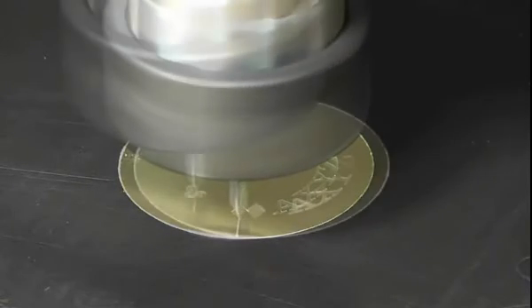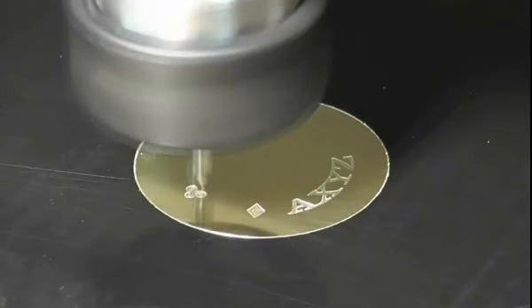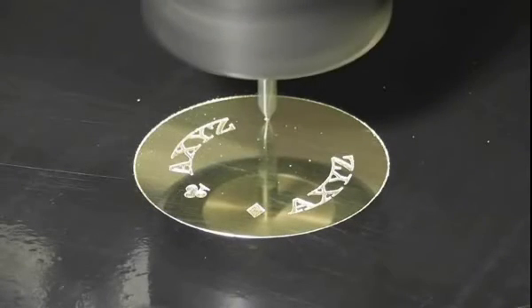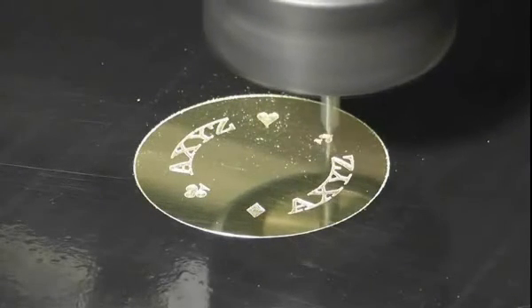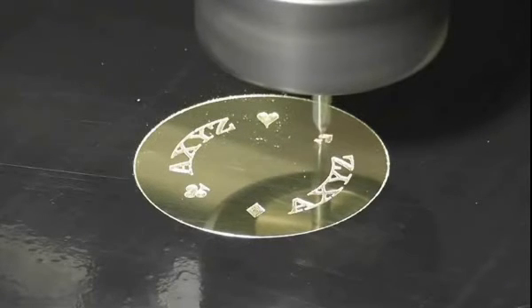In the first part of the process, I'll be area filling the shapes at a cut depth of 0.2mm. This process can take some time, but you can get some good results. Depending on the design, it may be possible to use wider tipped tools for large flat areas. This would reduce the machining time, but you'd still need to change to a smaller tool to maintain sharpness in the corners.